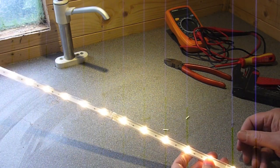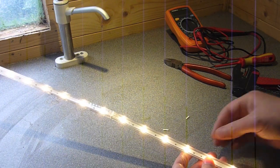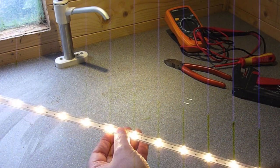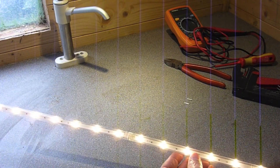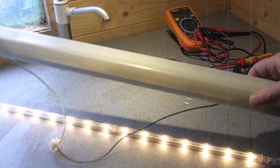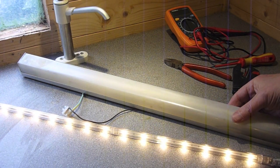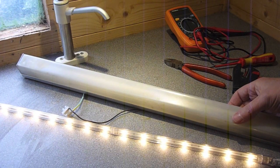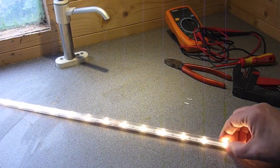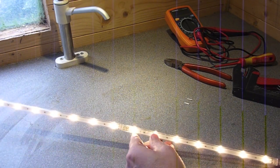What I like about these lights is that the electricity consumption is very very low, so they won't drain your battery too much and they'll last a long time. It's a good color of light — some LED lights give a very cold color with a high color temperature of around four to five thousand Kelvin. These come in at about three thousand Kelvin, which is considered quite warm, fairly similar to a standard incandescent light bulb. They give a really nice warm welcoming light. I've got a strip of these running across the top of my shed roof replacing an old fluorescent tube from a camper van, but it drew quite a lot of electricity and these LED lights are just absolutely brilliant. The pack of three together with the transformer is about £11 from Ikea.